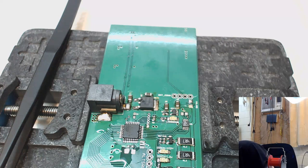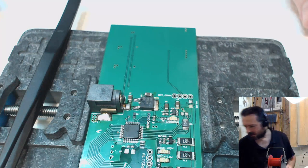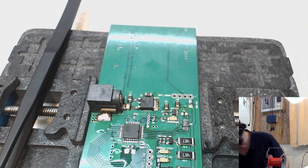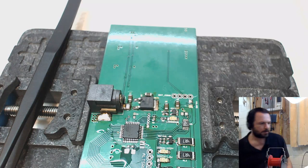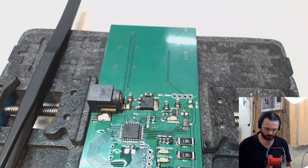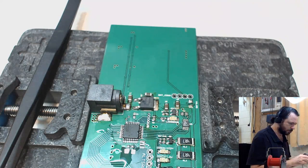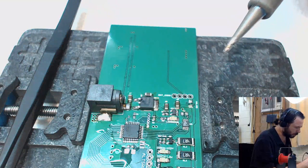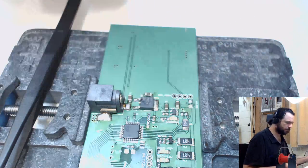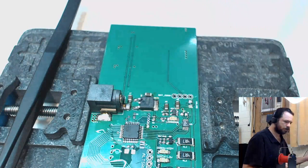There we go. We've still got to hack the board to make it accept our new configuration. Oh, it's an 0805. That's right. It all comes back to me now. Where are you? One microfarad. It's flipping useless. I'm going to put a 1206 on it. Oh no, we've just got to the end of our spool. That's way too much solder. I'll have to do.